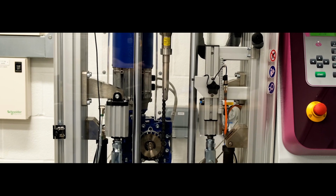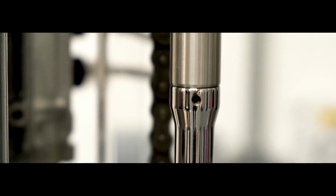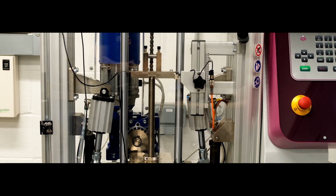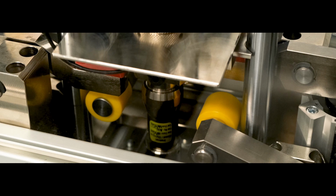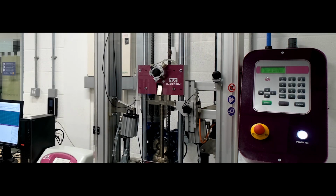Inside the turret, the tup releasing unit first travels to the desired position, then drops the tup from that height. The sample could be partially or fully penetrated. If the penetration of the specimen is partial, the anti-rebound system will clamp the tup to avoid bouncing. Finally, the tup returns to the original position and data is transferred to the software.